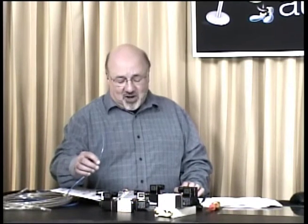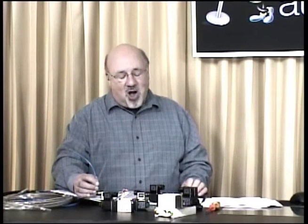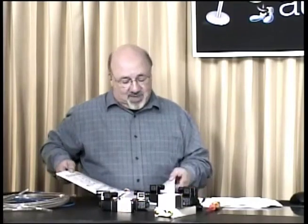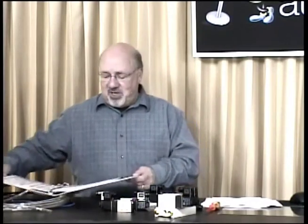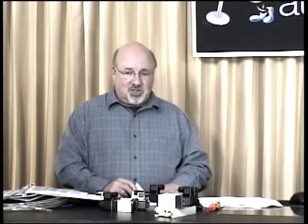So if you're buying fittings, this tubing is going to work whether it's the 4 millimeter or the 5/32 type fittings. And then we also offer a 1/4 inch, 3/8, 1/2 inch, and then in the metric sizes we go 6, 8, 10, and 12 millimeters. But that's all in the catalog. There's 126 pages in the pneumatics section of the catalog that has a wealth of information to use. So from the tubing we go into our accessories.